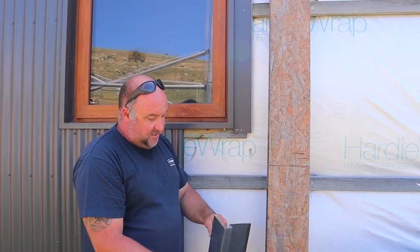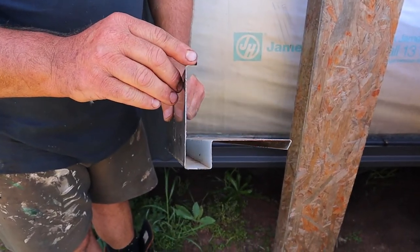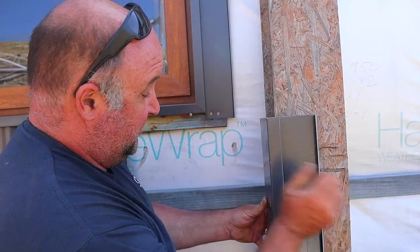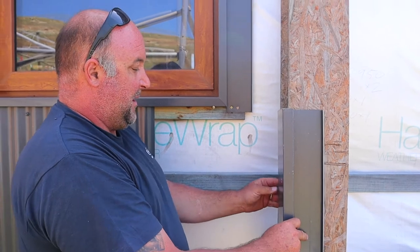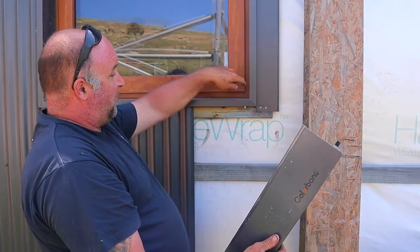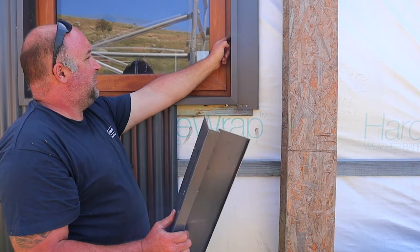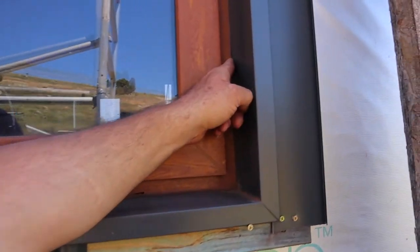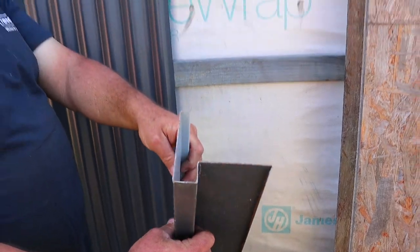You can see here I've done a little 15mm by 15mm bend. And that basically would sit — keep in mind there's some timbers on here as well — so that would sit like that. And then our window frame actually silicones and fits in behind here. Even though you can't see it here, the window frame actually goes another 15mm in that way, and that sits into that groove there. And then it's all siliconed, so that's our weather seal.